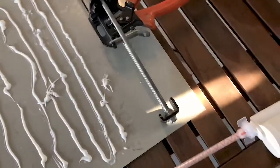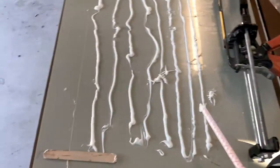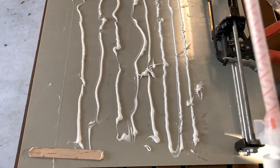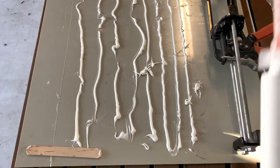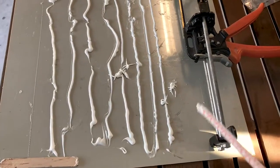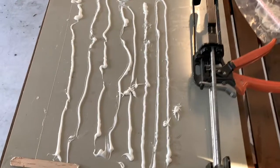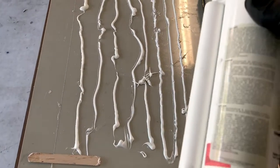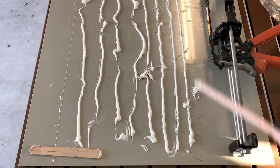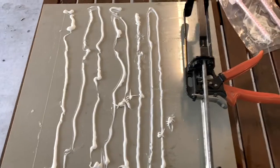And so when I did this test the other day, what I did was, after I did the bead of glue where I'd forced it out through a partially blocked mixing tip, I actually put a new mixing tip on and didn't purge it, didn't reset the height of the plungers in the bottom. The next bead that I did actually went really yellow, which is what Steve Moltari's been particularly complaining about. Some of his customers have had that issue. So we might try that now. Now that we've got uneven plunger heights in the tube, we'll put a new mixing tip on without purging it and see if the uneven mix ratio gives us that yellowing effect that Steve's been complaining about, that I had happen the other day.